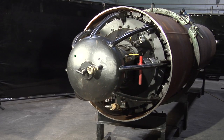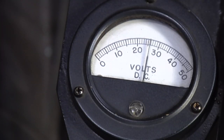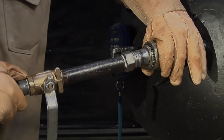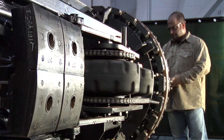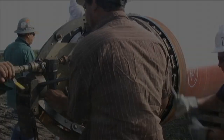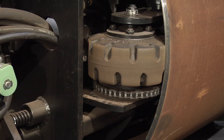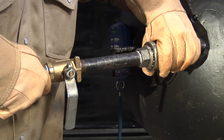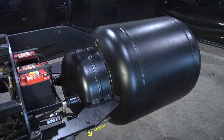Let's do a quick review of the copper backup clamp. The clamp is electrically powered by a self-contained 24-volt system. The main components of that system are the voltage meter, Anderson plug for charging, and the two 12-volt batteries that ride on the rear of the clamp. The pneumatic system uses air pressure to clamp the pipe during welding and to travel the clamp from joint to joint. The clamping shoes, drive wheels, and brakes all operate off of the pneumatic system. The main components of the pneumatic system are the air quick disconnect, the main pressure gauge and the regulated pressure gauge, the oil fog reservoir, and the two air tanks on the rear of the machine.